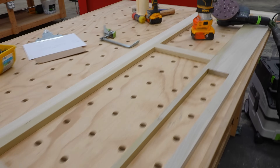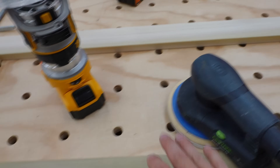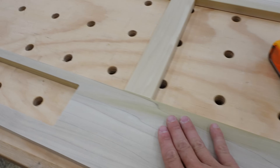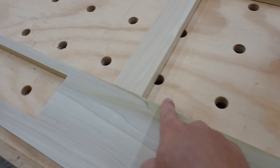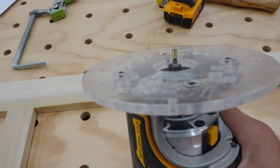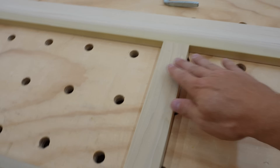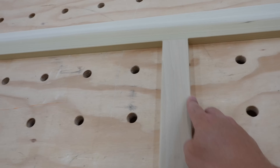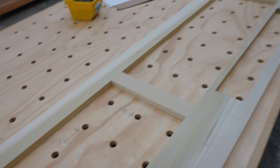Some key points when doing face frames: I sand with my Festool ETS EC 150 with a 5mm stroke — that 5mm stroke really cuts through the material quickly. The blue hard pad keeps everything perfectly flat, so it paints up nicely. On the front side of the face frame I very slightly ease the edge using a one-sixteenth-inch whiteside pilot-point router bit to get into the corners. This makes the edge more durable, paints up better than a really crisp edge, and is standard practice for site-finished cabinets.